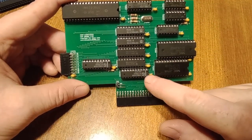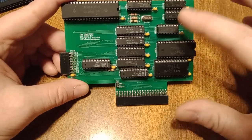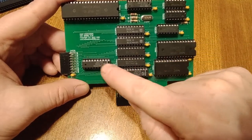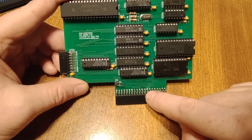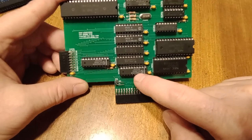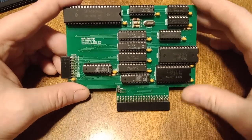The data is done the same way — there's an enable on the buffer to read or write from the buffer depending on whether it's a read or write cycle. One of the reasons this is double buffered is for the interrupt controller and system timer. There's a little mini internal bus and the Pi will decode and say you want port 20, and the chip enable line is connected to the Pi, so it doesn't give it any data — it just enables it and then continues on the bus. That has seemed to kind of work, but it's not perfect.